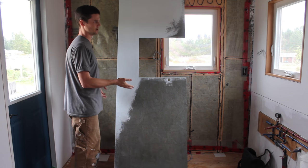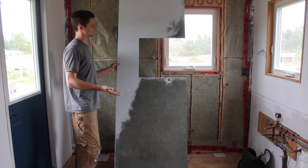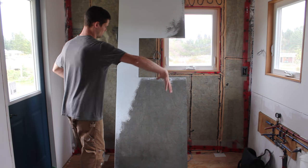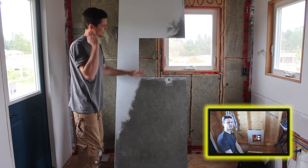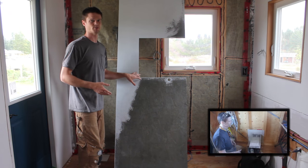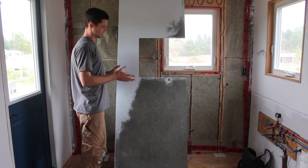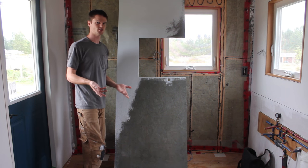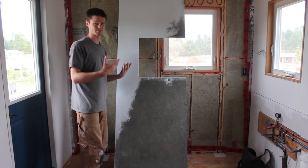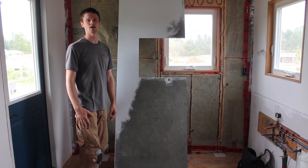Rather than wasting boards on an area that's going to be totally hidden, we've got just the most basic type of board and a sheet of OSB that matches very closely the thickness of our feature wall boards. I've cut it to shape to accommodate going around the furnace, and I've taken the time to cover the whole thing — including the cuts — with some bargain bin paint primer and the stain we got, just so it has some resistance to moisture in case there's ever a spill or moisture soaking into it. It won't expand, or at least it'll have some resistance to expanding or rotting.